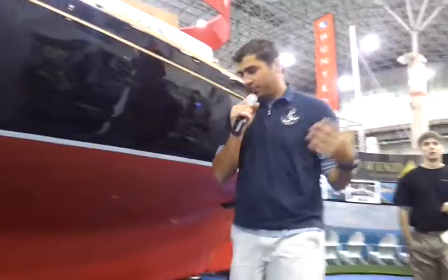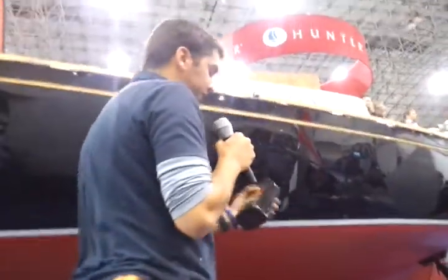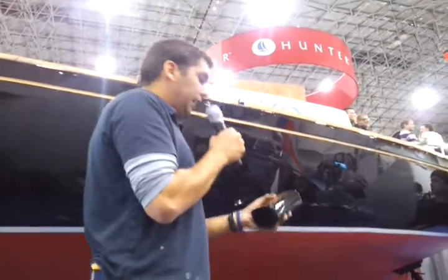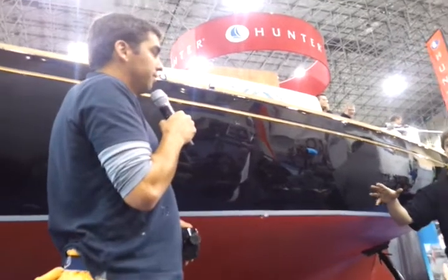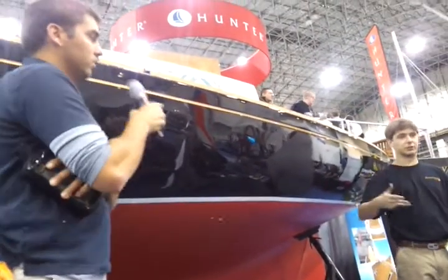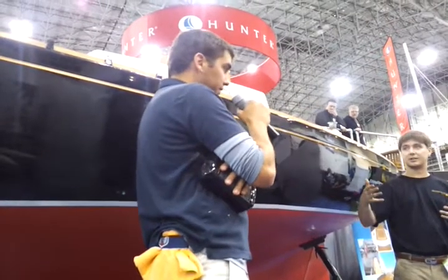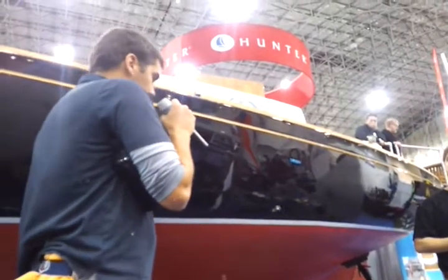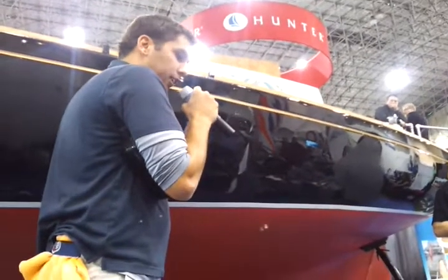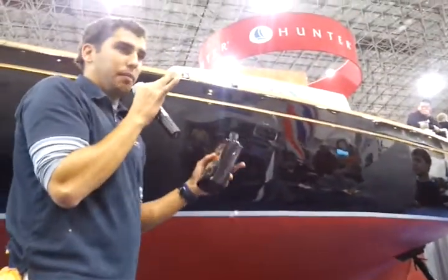Yeah, that's a great thing that we haven't covered yet. The question was, once you're done polishing, what do you do? We really like the 3M Flagship. Everything that he's been doing so far has been the abrasives we're talking about and the polishing. And it's not a UV barrier yet or protected or anything like that. We have gotten rid of the bad stuff and we have gotten back to square one, a good boat, let's say a boat that just came out of the factory. Now we've got to protect that. Obviously, wash your boat regularly, stay on top of your boat.